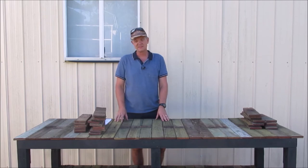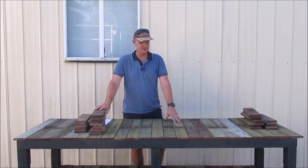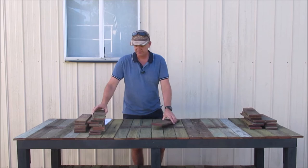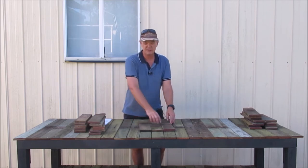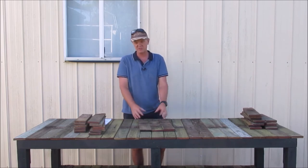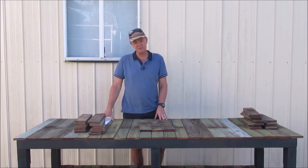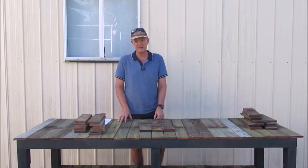What I'm going to use are off-cuts from the fence palings used for making my workbench. I might need to cut up a couple of extras for some of the slightly longer sizes, but basically I'll put a few together and put some timber strips across to join them all — that'll be one side. I've got my dimensions so I'll start cutting the timber to size and then start putting it all together.